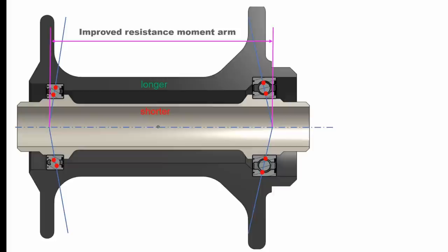This is another reason why I think they should do it the other way — to push all the inners inward. Because if you do that, the resultant bearing preload load path: the end cap comes on here and pushes on the inner races, pushing all the inner races inwards. Your load path is like this, and no matter how much you pinch the inners inwards, you're also applying an inward force to the outers.